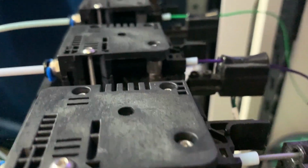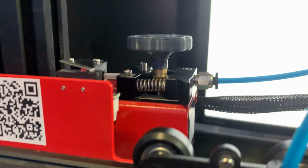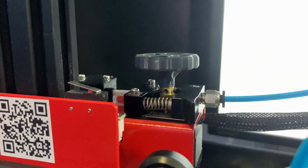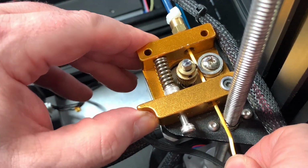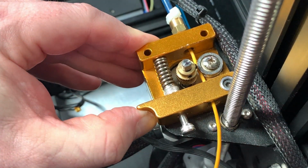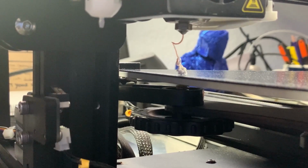with loading your filament. So there are two different kinds of extruders within 3D printing, the Bowden extruder and the direct drive extruder. Both are being loaded with filament, of course, very obvious. But one has a very long white or maybe blue color PTFE tube between the extruder and the hot end. So for the direct drive, you don't lose so much filament between the extruder and the hot end. On the opposite side, for the filament that goes to the PTFE tube, when you are going to load filament, you have to push a lot of filament right to the PTFE tube before the hot end is going to melt the filament onto your bed.